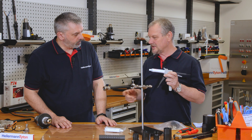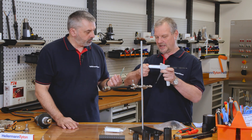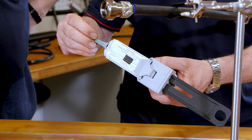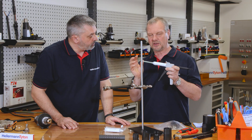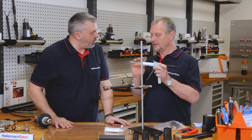The way we mix them is through a nozzle. We take the end off — it's really easy to use. This nozzle allows both the hardener and the resin to mix, so when it comes out the end it's already mixed. It goes in as two and comes out as one.